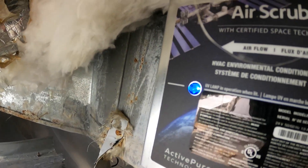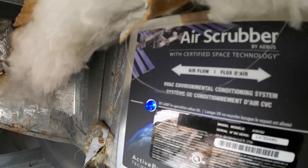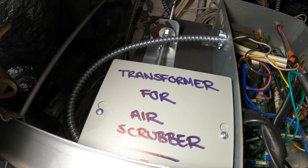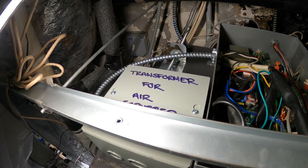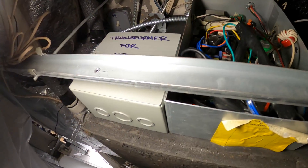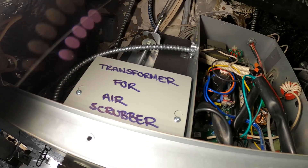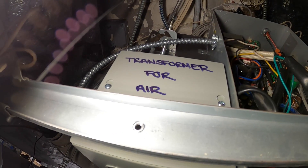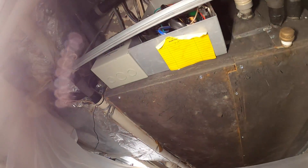Hopefully you guys can see — we got a blue light on there. Awesome. UV lamp in operation when lit. This is awesome! Mark this cover — can't find the cover to this one. The idea here is we're going to run the fan on fan-only just for now so we can kill the contaminants, and then we're going to wrap this one up. We connected 208 volts from our main line voltage feeding this transformer and stepped it down to 24 volts feeding the air scrubber. If anyone found this video interesting or helpful, please drop a like, comment, and subscribe as I come out with new videos every week. Catch you all next time.